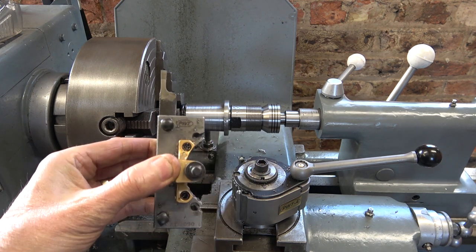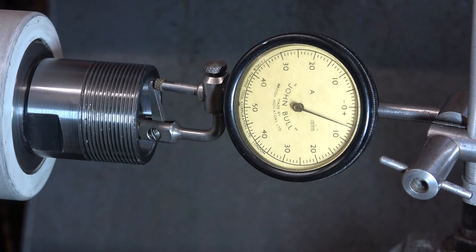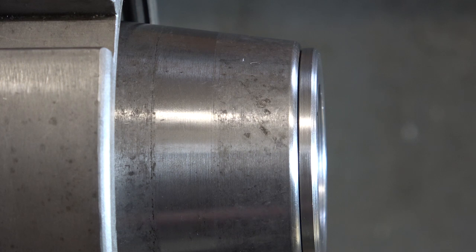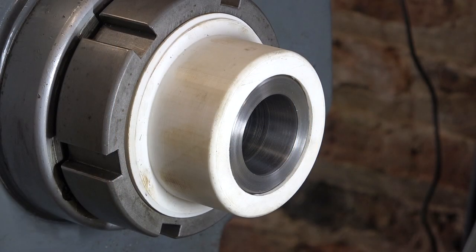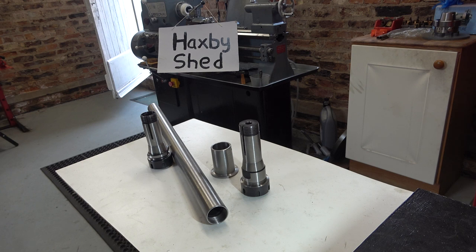I'm going to polish the taper next. I used this old parting tool so I could clear the chuck on one side and work up to the collar on the other. A little bit less than a thou, I think. I'm just going to finish by taking a fraction more off the back edge of this collar. That's better — that's with the bush tapped in and firmly snugged down. With the feeler gauge: 0.15 millimeters. With the spindle nose cover on, the bush looks pretty smart. 0.15 millimeters is 6 thou imperial. I must feature this picture produced by my granddaughter Emily — she wanted me to include it. I think the real hero of this has been the multi-fix toolpost, because you can see just how versatile it is. I hope that's been useful to you. Thank you for watching Haxby Shed.